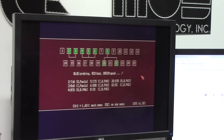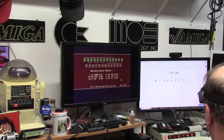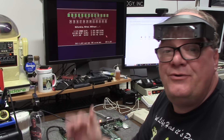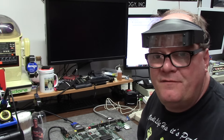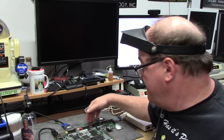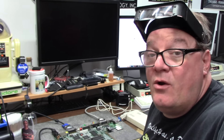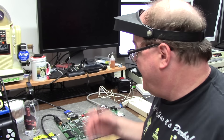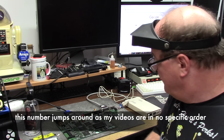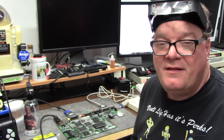Going to serial/parallel test — running the serial test — bingo, all green! So the problem was both U28 and U29. U29 was missing some pads. Mr. Daniel should be extremely pleased: his Amiga 1200 has been repaired and is functional again. He can use his old dial-up modem. That is a repair of the serial port line drivers U29 and U28 — two little line driver chips went bad, owner provided replacements.